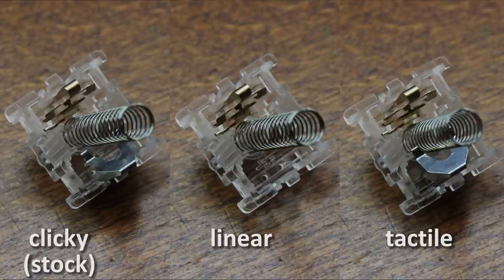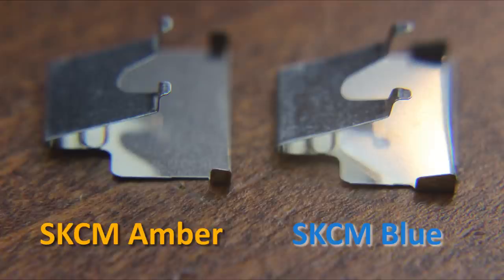Uniquely, you can even switch it to tactile non-clicky by moving the leaf ahead of the slot it's normally housed in, which is accompanied by a significant increase in tactility. It's not as easy to do as with Alps switches because these open from the bottom rather than the top, and the tactile mod is a bit fiddly because the leaves can be a bit annoying to fit in properly. But the fact that you can fully reversibly mod this to linear or super tactile with a single design without using any extra parts is quite remarkable. Speaking of tactility — in Alps switches this is mainly determined by the angle of the teeth; the more they stick out the more tactile the switch is.